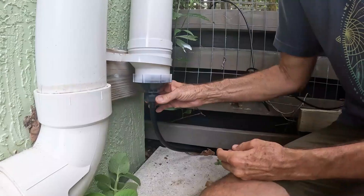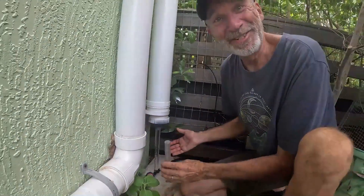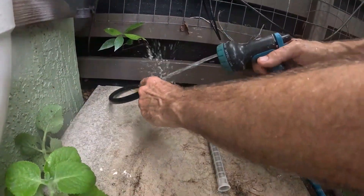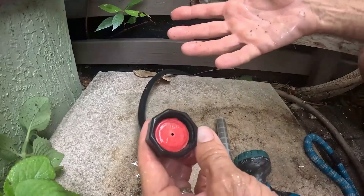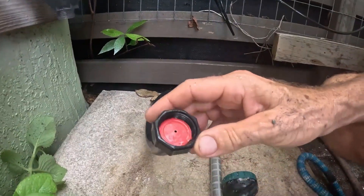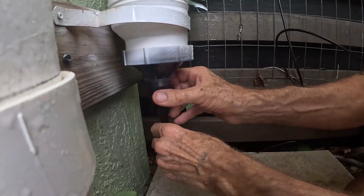There's basically a screen and a filter in here that we have to clean every now and then. So that was totally clogged — this is long overdue for a cleaning. This hole controls the rate of drip, so you want it to be small so it's a slow drip, giving the water a chance to fill up so that the following rainwater gets diverted. These first flush units come with several different size washers so you can adjust the rate yourself. The ball is right in there — this filter pushes up on that ball, and then this fitting holds everything in place.